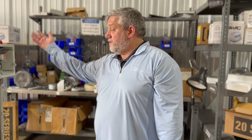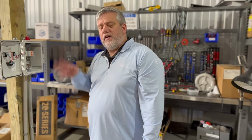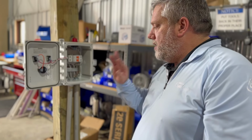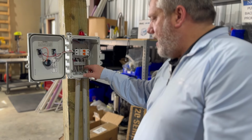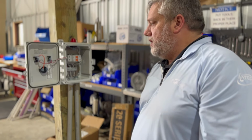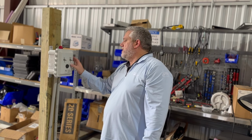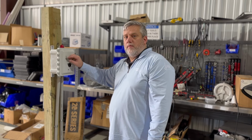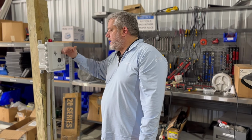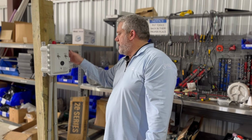This is for professionals too. A lot of them don't know how to wire a panel like this up, or they're kind of scared. This is a very simple panel. It's a good panel to start on for you guys to know. Because you got your pump circuit, your alarm circuit. Everything's really simple in this panel. So I got everything here. Even got test, silence. So if the alarm's going off at 12 o'clock at night, you can silence it, and it's still going off. You still have your red light on. But that's it.